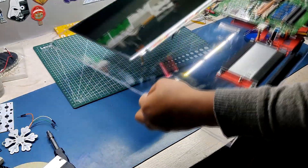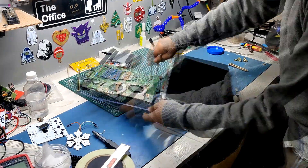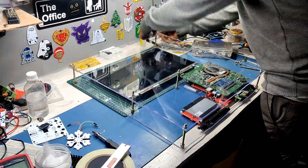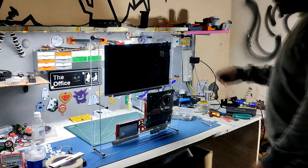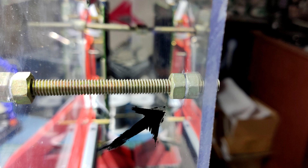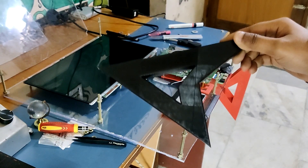This setup already looks pretty sick. After placing all the electronics, we add the front acrylic sheet using 6 M5 bolts and 18 nuts. As a result, we now have a durable and solid transparent PC body composed of two acrylic sheets attached together with nuts and bolts. One nut holds the single bolt in position, a second nut holds the second sheet, and a third nut holds the sheet firmly in its place. Temporarily removing the front panel, we then use three long M3 screws to attach the 3D printed stand.